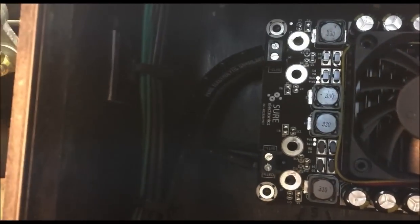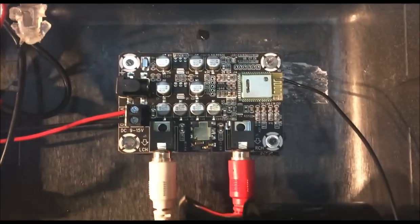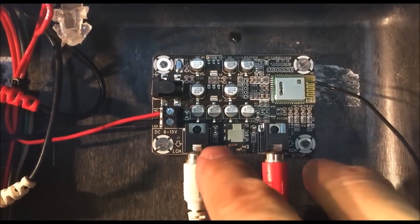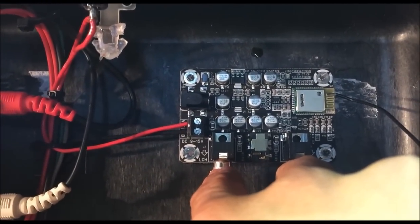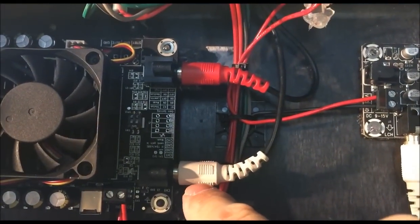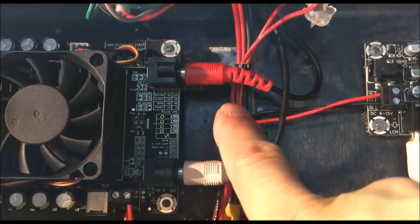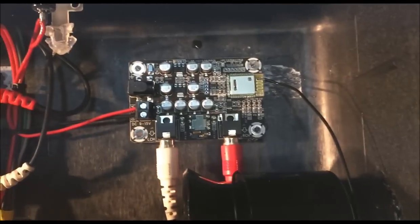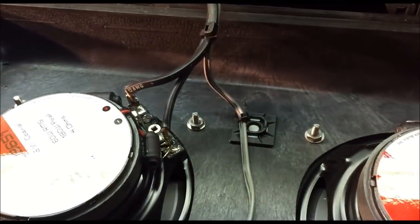On the right side of the amp, you have the left and right outputs. These modules don't really label left and right, so you just have to make sure your RCA output from the Bluetooth is consistent — since you're getting your music signal from your Bluetooth-enabled device. I've routed the wiring all the way around and down to the input of the stereo D-class 50-watt amp. One will be left, one will be right. It really doesn't matter which wire is which as long as you're consistent with the signal routing. Then the speaker output cables — leftover speaker cable — get wired to each of the speakers.